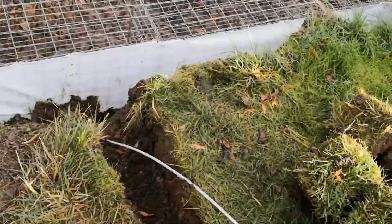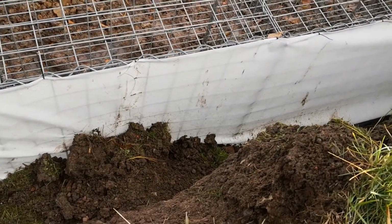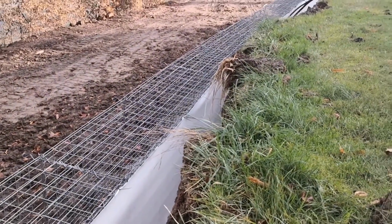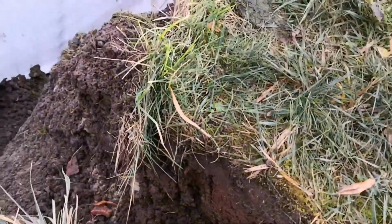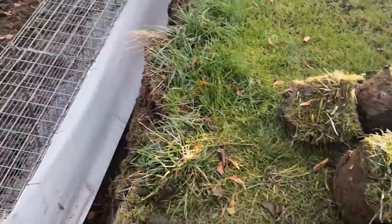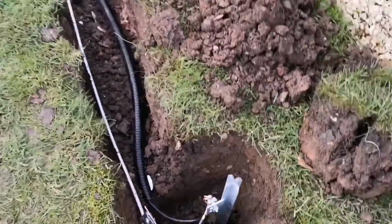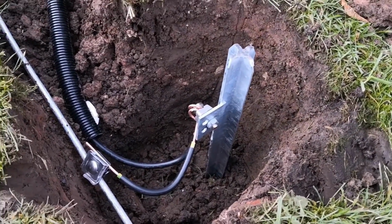I will carefully lay the cable down here and leave it securely on the reel over the winter. Continue steadily in this direction in the spring. In the end, under the gabions to the large area, the grounding wire will be securely buried in the ground. I also fill everything behind the gabions with soil. The potential equalization can therefore take place over a large area. The compensation occurs through the grounding electrode that I have driven into the ground.